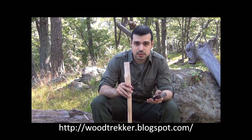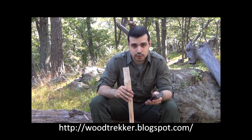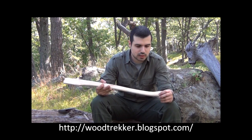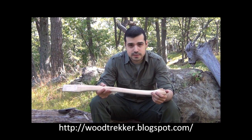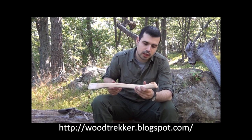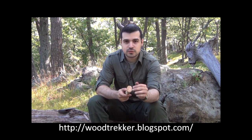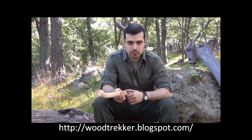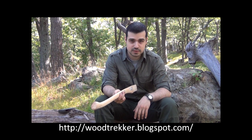I just wanted to show you some of the basics in how to do that, in case you want to do it at home. A couple of things to note about the handle. First, examine the grain. Don't make the same mistake that I made. Ideally, when you look at the handle, you have the grain running vertically. This makes for the strongest, most impact resistant handle. You also want the grain to run the whole way to the length of the handle. That is where I made my mistake — my grain actually veered off, and that's exactly where it ended up snapping.